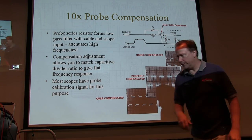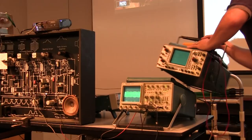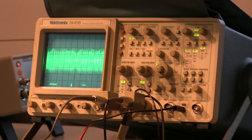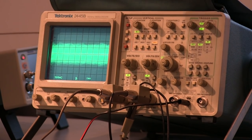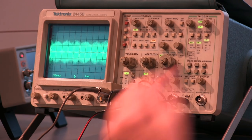Let me show you what I mean by that. We'll do it actually on one of these waveforms. Let me move the scope out of the way, because I think I got my screwdriver inside here. Ideally you want a non-metallic blade, because a metal screwdriver will detune it. A non-metallic screwdriver, or one with just a tiny little metal blade in it, because that's 10 megs. So let's actually grab this guy here.